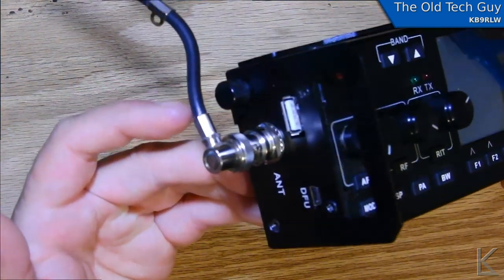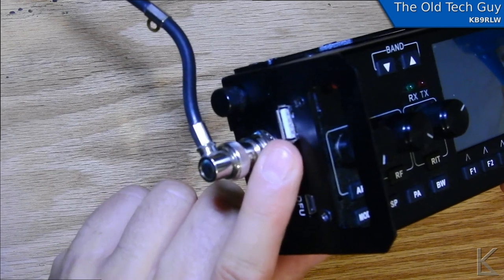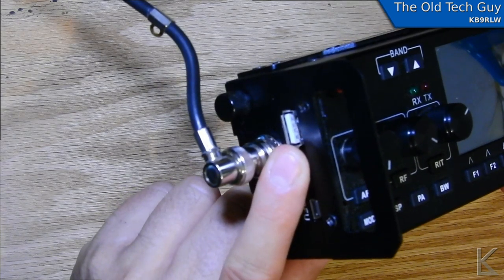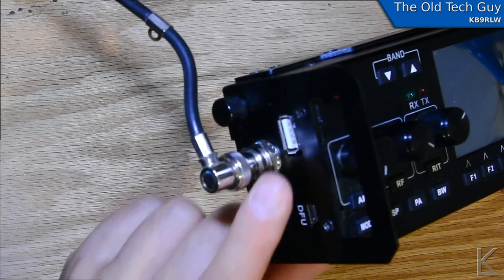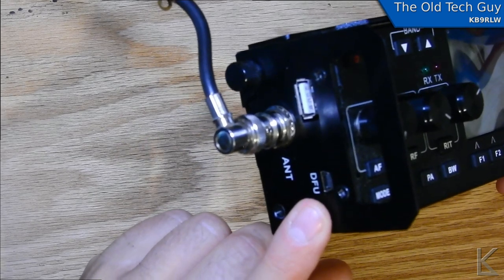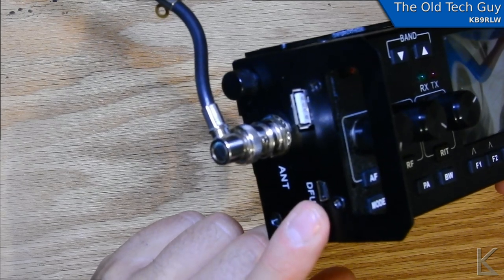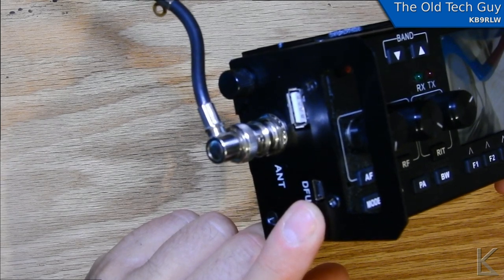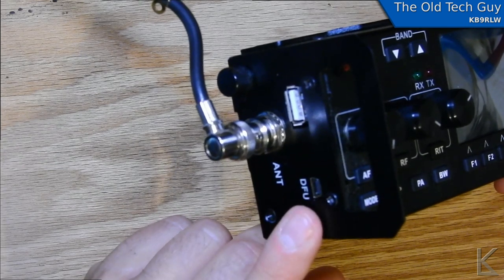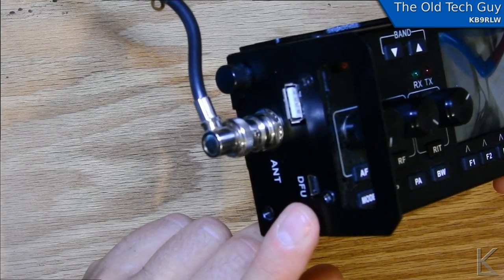Connectivity on the sides: there's an antenna port and two USB ports on one side. The regular USB port is for doing firmware updates, and apparently they're going to incorporate a keyboard in upcoming firmware to allow you to send digital modes directly from the radio with a USB keyboard. Then there's a micro USB port that provides one of the big rig features I really like — when you plug this into your computer you get a sound card and a serial port. The sound card is for sending audio to and from the radio for digital modes, and the serial port is for rig control using the FT-817's command set.